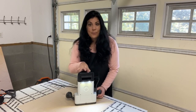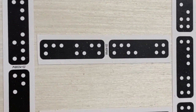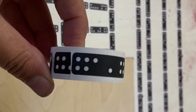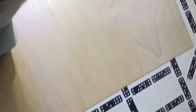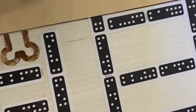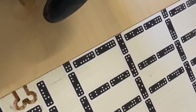Let me bring you in closer so you can look at the dominoes and the setup. Here is the workspace — you can see the dominoes up close. They come on a roll like this, and the rolls aren't especially cheap — they're about $18 each, so we like to reuse them as often as possible. We created this board that's covered in dominoes. This is actually a waste board from a cut we didn't like, so we ended up reusing it. We can put the piece of white birch right there inset among the dominoes, and as we're cutting, the Shaper can always see one or two sets of dominoes to know exactly where it is and how to cut accurately.